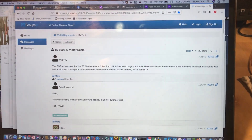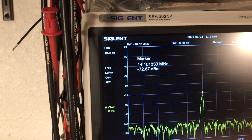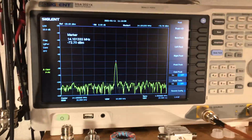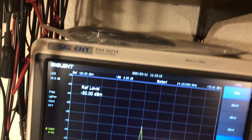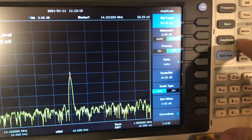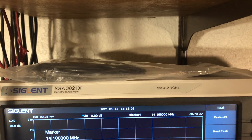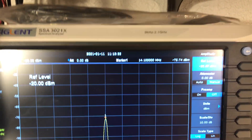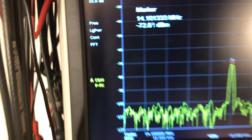Okay everybody, I think I found the answer to my questions on why my S meter on my Kenwood TS-890 is reading S8 when the input is minus 72 dBm, or 50 microvolts. I changed the scale from the previous video. If I hit amplitude, you can go by either volts - hit units - and volts should show about 50 microvolts. Some people want to read that in dBm, so this analyzer can do that. We just pick dBm and re-peak, and right there, 72 dBm, flickering around somewhere thereabouts.